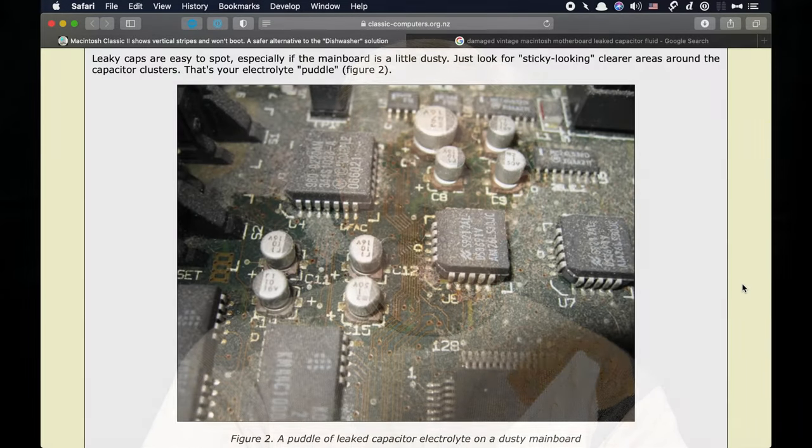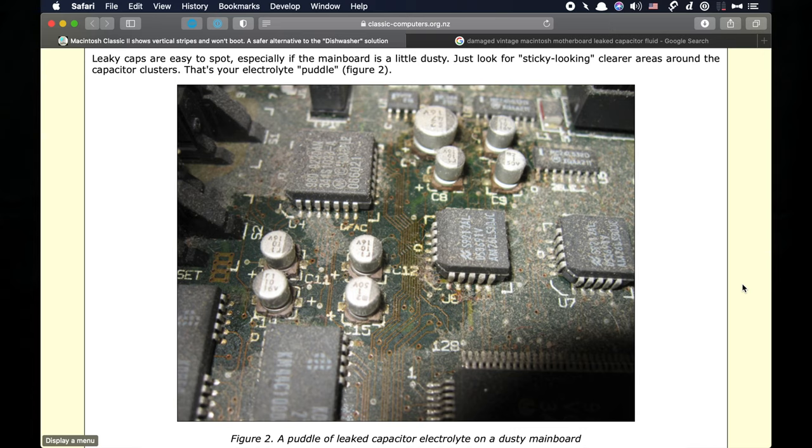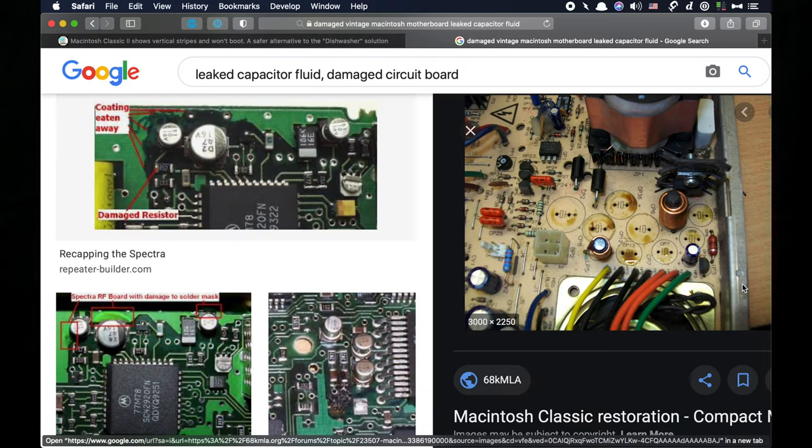And you know, these capacitors are just like anything in life, folks, like your clothes, like your shoes, like your house. Nothing lasts forever. And the little seals on these capacitors, they'll eventually break down and let the fluid electrolyte flow out. And even if that electrolyte doesn't flow out and damage your circuit board, which it often does, still, the leaking out of that fluid electrolyte is slowly transforming your capacitor into a resistor.